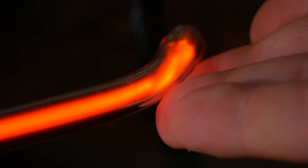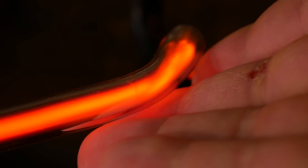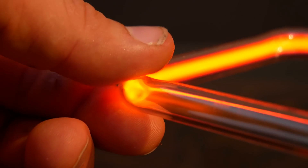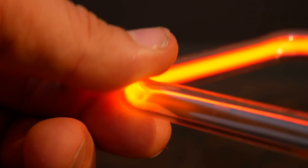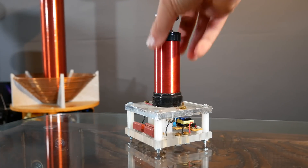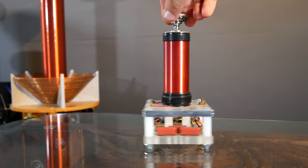The plasma itself is the first conductor, the glass is the insulator, and my skin is the second conductor. Here's how it works: when I touch the glass, the little amount of power that's present in the ionized gas capacitively couples with my skin, and is encouraged to fully discharge at the point of the glass that I touch. This is the exact same science behind touching a plasma globe, and the same reason why smaller Tesla coils don't need a solid ground connection, and can just use a counterpoise instead.